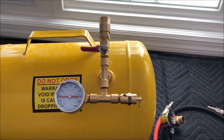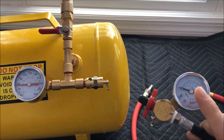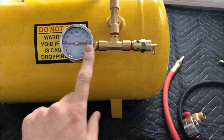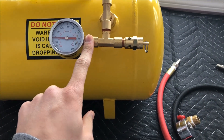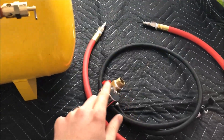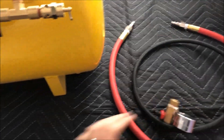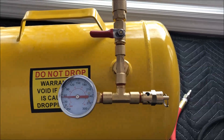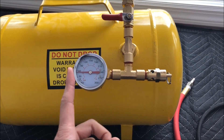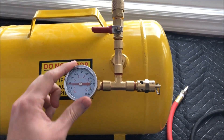Okay, so here is the end product. What I realized when I took off the manifold that comes with the tank is that the gauge is actually one eighth inch. So if you wanted to reuse that and put it on here, you would need a reducer — a one quarter inch male by one eighth inch female reducer — and then you can screw that in and attach the gauge. If you look for that reducer, it's actually not very common, so you have to go to Amazon and get one. It runs about six or seven bucks. So sometimes you just consider getting a new gauge from Home Depot for about $8. I just did that instead and mounted it on, and this is what it should look like.